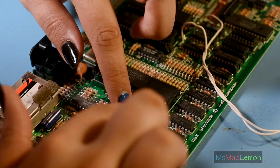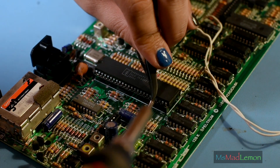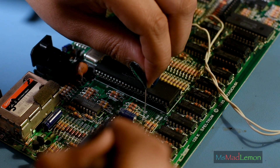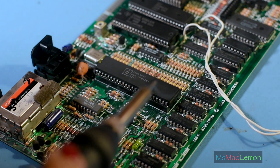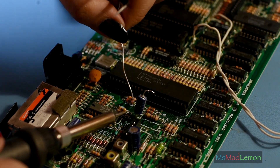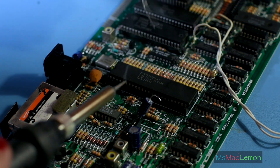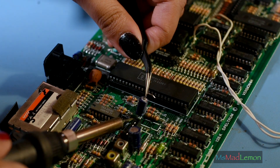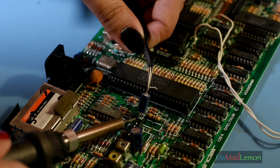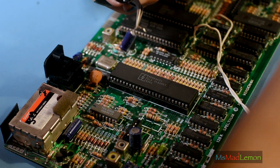I'm running out of space on my card — three minutes left. Let's see if I can do this capacitor in three minutes, or at least remove it in three minutes. I'm adding fresh solder first. I'm going to add fresh solder to this, and just gently pull up — heat that up. There we go, that's easy. Did it in a minute.